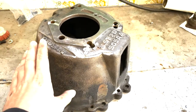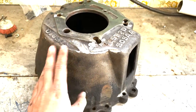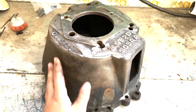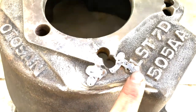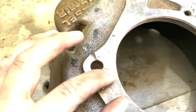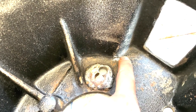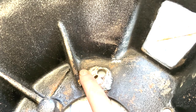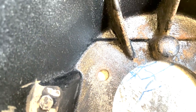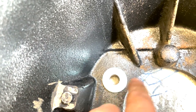As I told you earlier, we've got a crack in our flywheel cover. Here we can see the crack — I cleaned the whole cover and prepped the crack for welding. I also saw there are cracks on another area, and on the inside you can see the other side of the crack. I'm going to weld it from both sides so it's plenty strong. On the other bolt side where a crack was found, I'm going to take a washer and weld it right around it to add a little bit of strength.